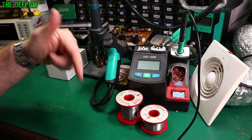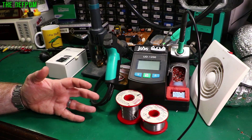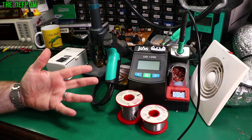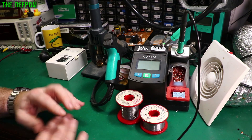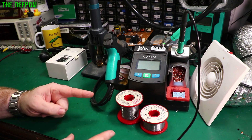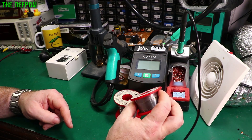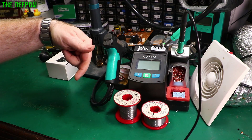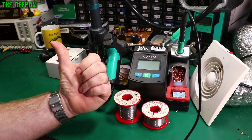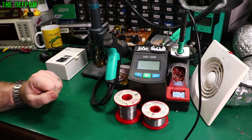Maybe you want to disagree and put some comments down below. But if you're starting out from new, by all means use lead-free — no reason why you shouldn't if you're not repairing old equipment. A lot of modern equipment is made lead-free, so no reason why you shouldn't use it if you're not too worried about things lasting 10 or 20 years. Personally, I use leaded because a lot of stuff I work on is old test equipment that was assembled with leaded solder — this one even has silver in it, high quality. Take a look at the playlist for the rest of the electronic tools series. There's a subscribe link if you haven't already, and a Patreon support link if you feel like supporting the channel and helping make more content.